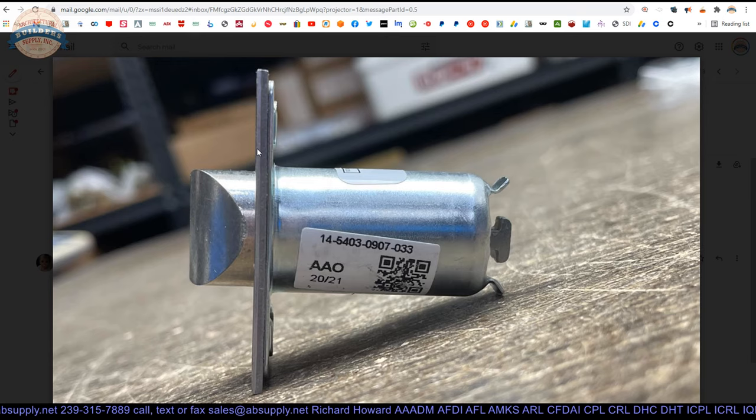I had a client a couple of weeks ago — they manufacture their own door and had a testing laboratory test it. It failed. They had, coincidentally, a Yale lock, and the lock failed not because of the lock itself but because of their door design. The testing laboratory said that if they got a three quarter inch throw on the latch, it would pass. So the client ordered three quarter inch throw latch bolts for their existing grade one Yale lock. I spoke to them last Friday and I believe they passed because they didn't call back to say it didn't work. Be very mindful of that half inch latch throw.